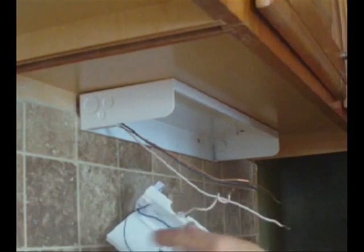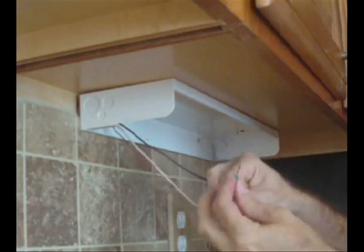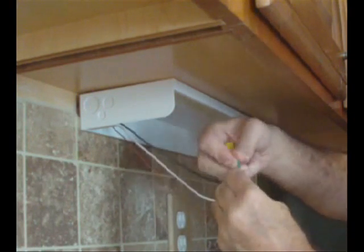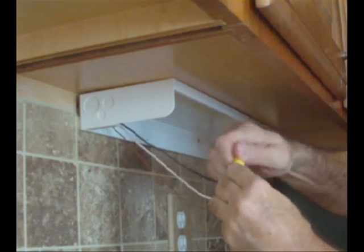Now if you take a look here, I've got several colors on the wires. I've got green, black, and white. The rules of this game are always the same — you match white to white, black to black, and green to green. In this case it's copper coming out, and I know that's my ground. So the first thing I'm going to do is ground. Because this is not a solid core on the green, I take it and just make it up a little bit longer than what I'm attaching it to, so that the ends connect.